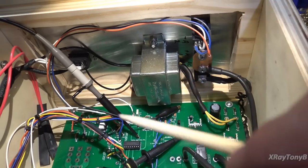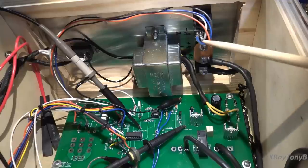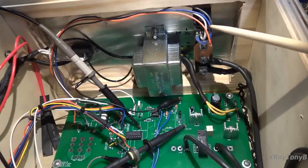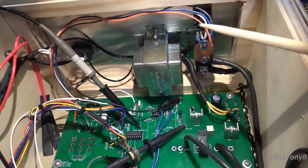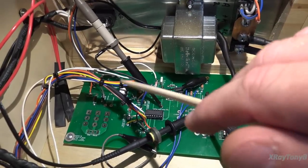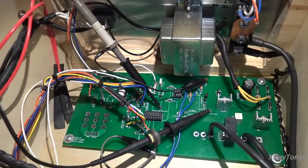There's a little bus bar that attaches one end of the SCR pack, and then this terminal is the other two ends of the two SCRs connected together. The control wires come down here and go into the board. The orange and blue wires are the actual gates for SCR1 and SCR2, and the other ones represent the cathodes — you need the cathode just for the feedback signal, not to carry current, because the circuit board needs that for its turn-on and turn-off circuit for the opto-isolator.